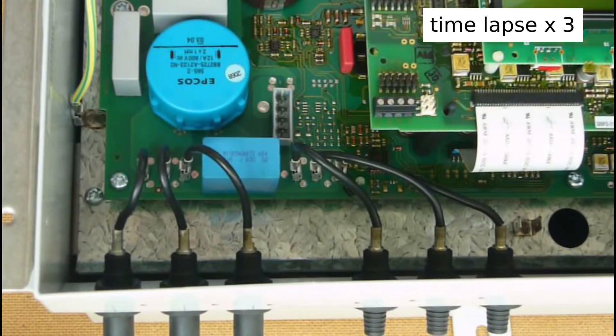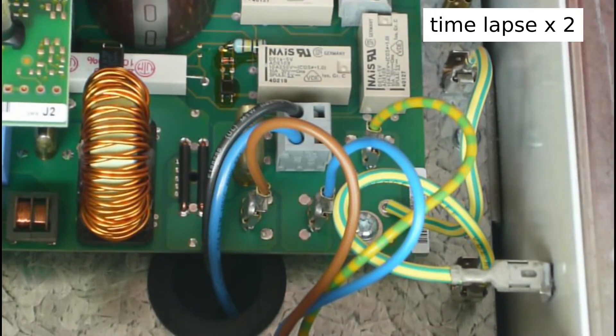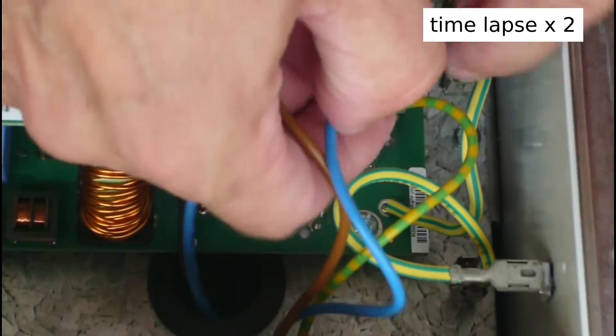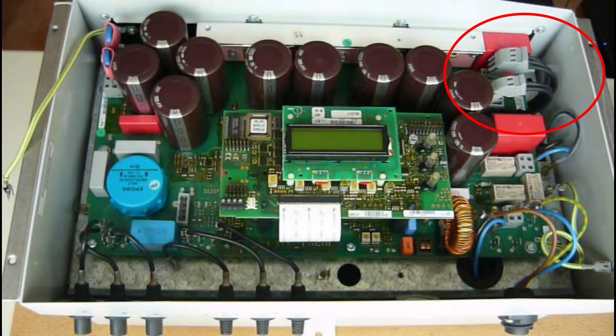Disconnect the lines. I disconnect the lines to the solar panel strings, the line for the protective ground, and then remove the wires on the other side from the main board. Also the two-pole and three-pole connectors shown in the red circle must be removed. The three-pole connector I had already pulled out before the photo and not inserted completely due to the high pull-out force caused by the locking hooks.